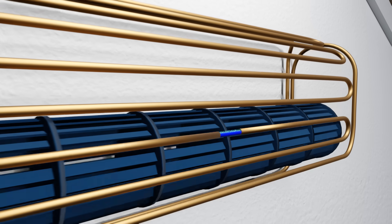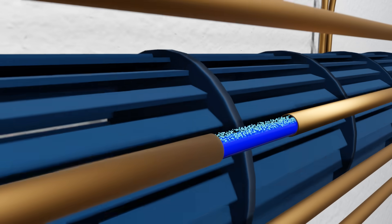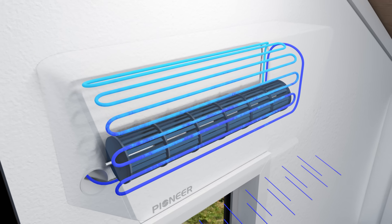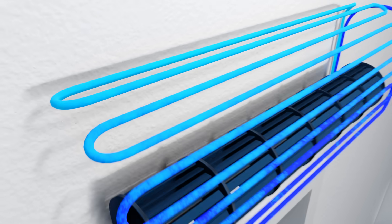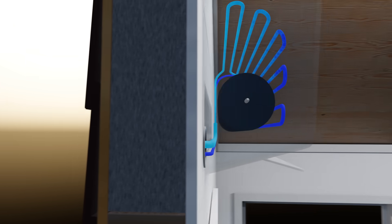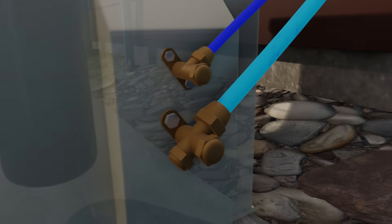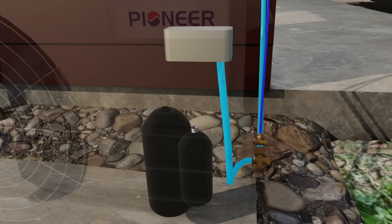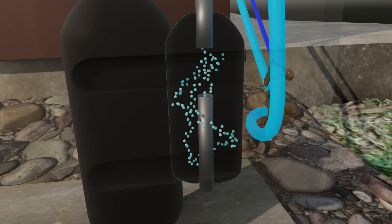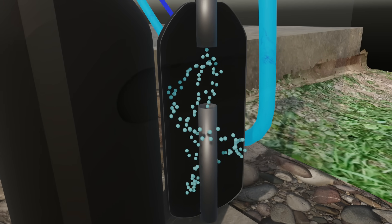The liquid refrigerant begins to boil as it absorbs heat from the air. Like we described earlier, this phase change allows the refrigerant to suck up a lot of energy. And for most of the coil, the temperature of the refrigerant isn't actually rising — all of the energy it collects goes directly towards helping those particles break free from one another. It's not until all of the refrigerant turns to a gas that its temperature finally begins to rise. The gas then begins its journey back outside. Once it's inside of the exterior unit, it travels through a four-way valve and an accumulator. The accumulator is just a small device that makes sure only vapor refrigerant can continue on — if we still have liquefied refrigerant by this step, it'll just collect at the bottom before it eventually boils off.